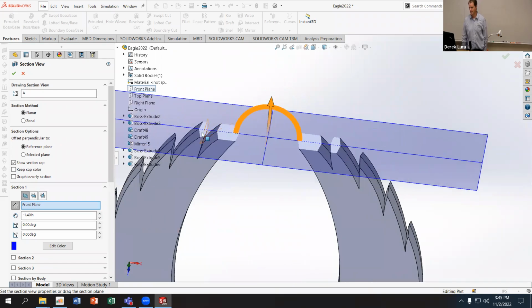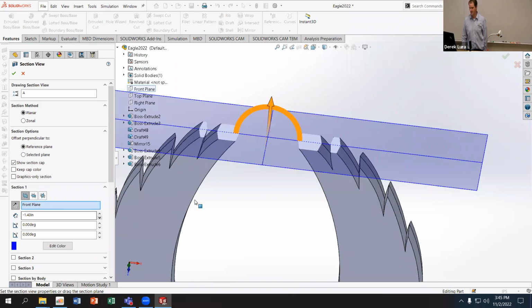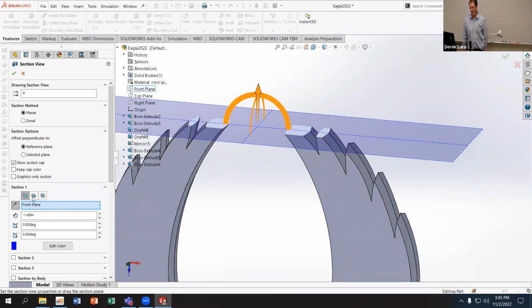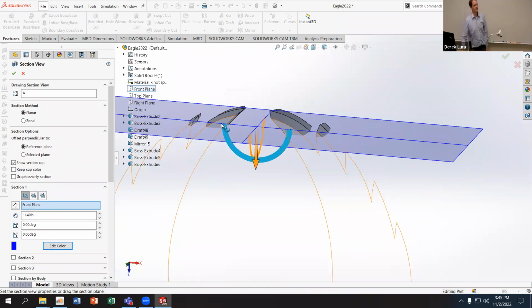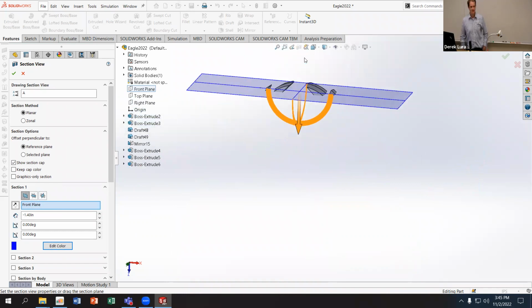So one of the things I want to watch out for here is, as I fill this, you see that I have two separate cavities here. That's going to be the void space, and that's going to be the filled space as I flip it back and forth. The problem with this is as I fill this up and I go through all these little feathers on the eagle, I'm going to have an air pocket inside of this tip of the feather here. That is no longer connected to where the rest of the part is filling up. So even if I fill this thing from the bottom up, there's not going to be a way for that to escape. Does that make sense?